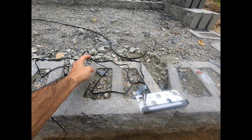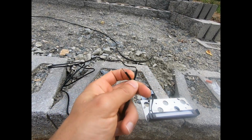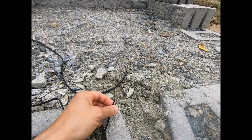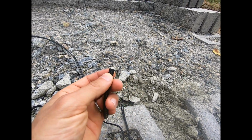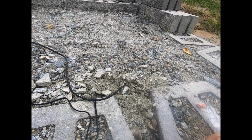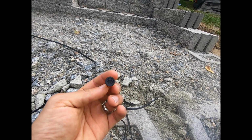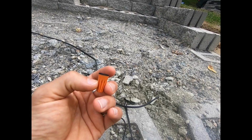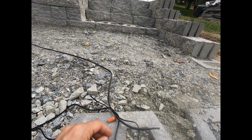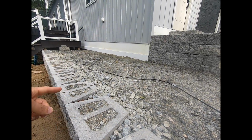and they usually come with about a 4 foot or so, 3 feet wire, and it kind of looks like this. It's already spliced. So you're going to do the same thing with the wire that you're connecting to. We're going to splice this, take the jacket off a little bit, and then you want to use waterproof connectors, right? These are waterproof connectors. There is wax inside of here, and in my next video I'm actually going to do that and show you how we're going to repeat the process for, I think we're doing 3 lights here.